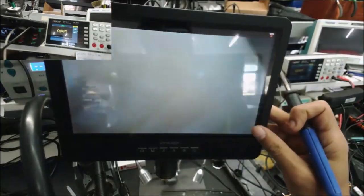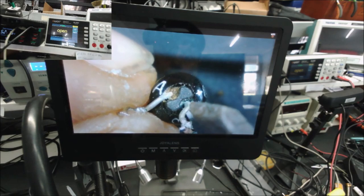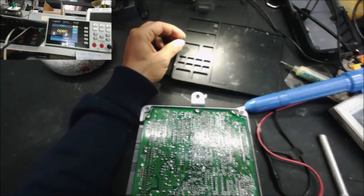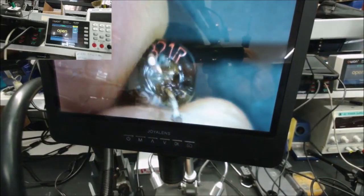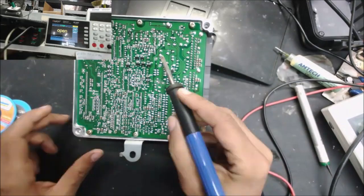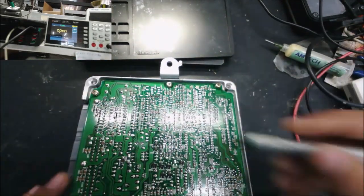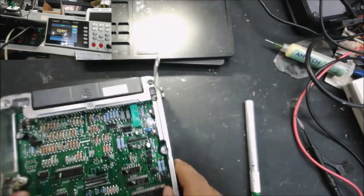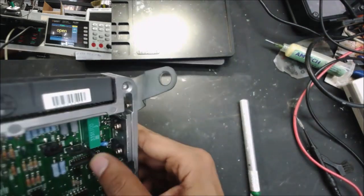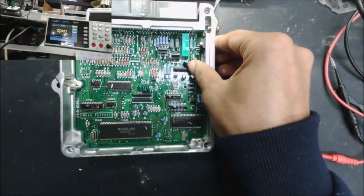Let's look under the microscope just to see how it looks, to have the idea. If you see it, you see that the oil was leaking from this pad. Other capacitor. Yep, it's leaking as well. All right, this one and this one, these two, three here. Let's see what this one here is. This is 100 microfarad and 10 volt.